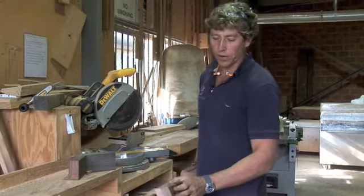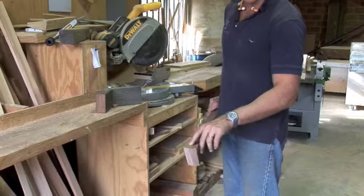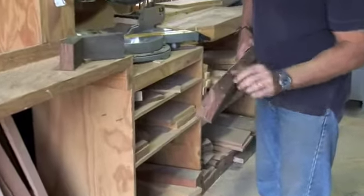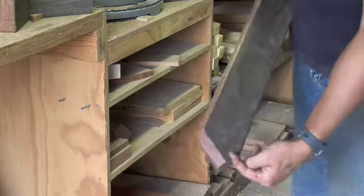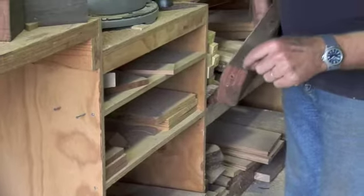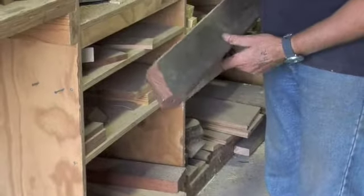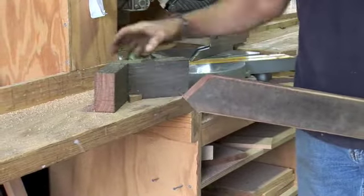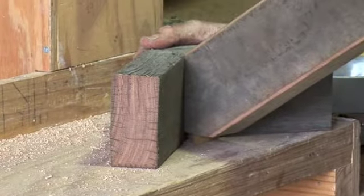This is one of the finished rafters — a tertiary rafter. Each rafter has a different way of connecting at the top; here we've drilled a small pilot hole for a nail. At the bottom end you'll see two angles cut there. We've also got a horizontal cut at the bottom, and a hole drilled running up through there — that's for a batten screw to hold this rafter down to the top of the post. It's easier to drill from this end back up through the rafter rather than coming down from the top. These angles are designed to fit in when the two top trimmers meet on top of the post, so the rafter sits in there like that and it all sits together forming a nice intersection.